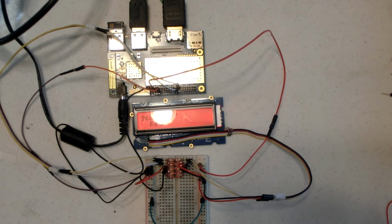The next video we're going to hook up is we're going to take the I2C bus, but we're going to go into the temperature sensor, which is a 1.8 volt device, so we won't need a level shifter. And we'll get that running.